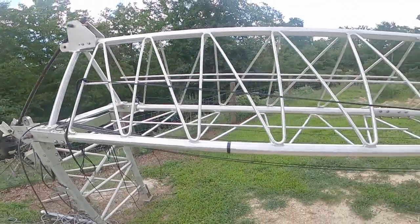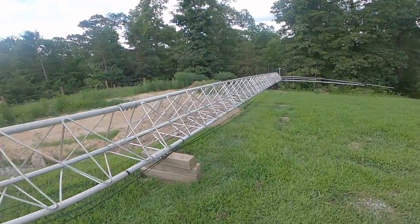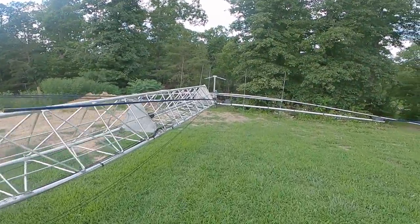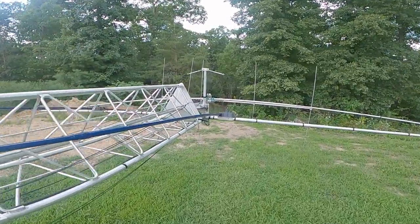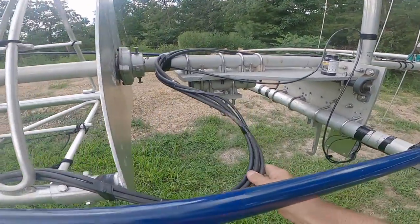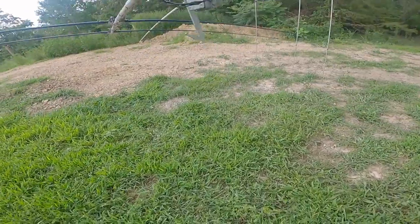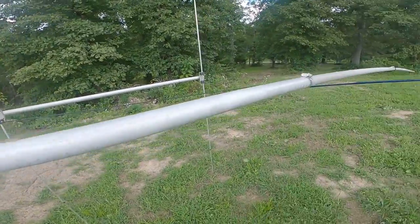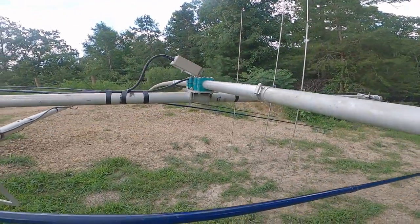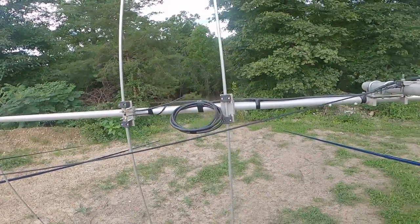Here's looking at the base of the tower. I've mounted four ropes to pull up, going through a pulley at the top of the tower — these will be about 80 feet up. This will allow me to pull up something like a wire four square or wire dipole as a phased array on 40 meters. There's our coax loop at the top. The next antenna up is a homebrew 30 meter rotatable dipole with a one-to-one balun right there in the middle — this thing works really well. I've also got a five element six meter beam on about a 16-foot boom, all homebrew as well.